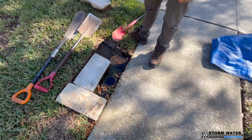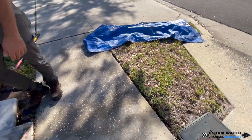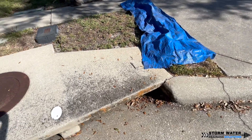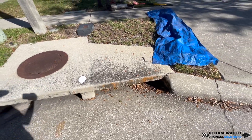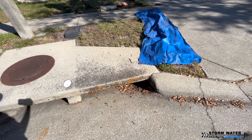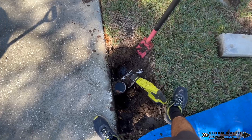What we are going to do is extend this drain line underneath the sidewalk and install one of our percolation tees with a French Drain Man pop-up emitter and turf restrictor plate. That way the water can just drain right over this curb and into the storm drain. So let's go ahead and get started.